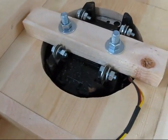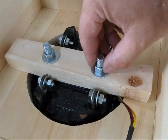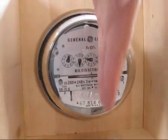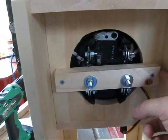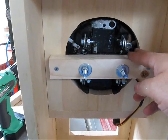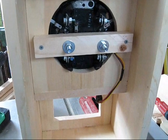I got it in there snug. I'll mount screws here and here so that this board doesn't move — that way, these bolts only have to be snug. I need to make sure that this is plumb. There's the meter all mounted onto the box. I split the wood a little bit right here, but I think it'll be all right. Part of the reason I wanted this to be sturdy was so the bolts didn't have to do a pinch-type clamping action and risk the JB Weld coming undone. Next is the three-gang box, switches, and getting everything wired.